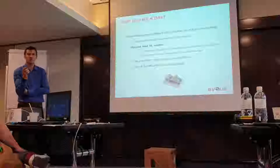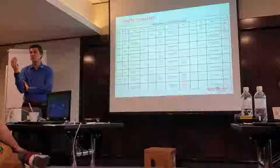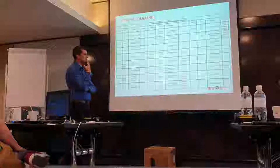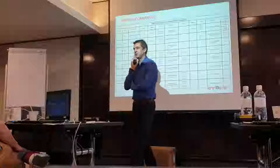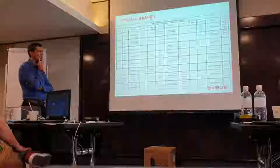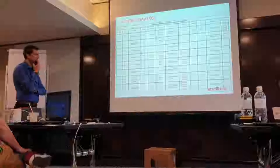Print head, I go fast because we have already talked about the print head. Okay. So now, some parts of the list. This afternoon we'll see the full list. Okay, the list is like this. So this is some information that we have already talked about, yes or no. One thing that will be good here is this one, RMP, to restore the manufactured parameters. Sometimes when you are lost or when you have touched lots of things, okay, you can restore. You restore all the information, not the offsets. The offsets are not restored, but almost all the others are restored by default. Okay.